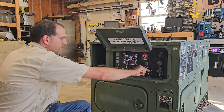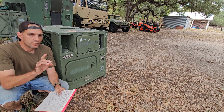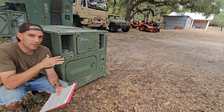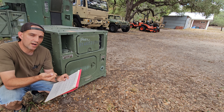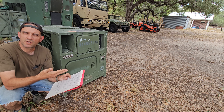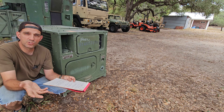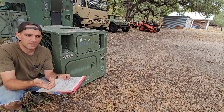Just a follow-up on two small things. For the auxiliary pump and why it didn't kick in during the test — off camera, what I did is I swapped the connectors from the main fuel pump and the auxiliary. When I went to prime it, the auxiliary pump kicked right in because it was being triggered as if it was the primary pump. When I put it back and moved it to prime run, after about four seconds the auxiliary pump did kick in. I think the problem was I literally just didn't push the connector all the way together — that was a hundred percent my fault.